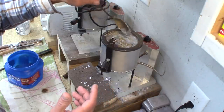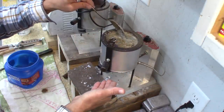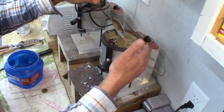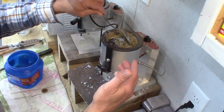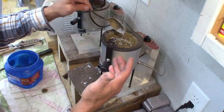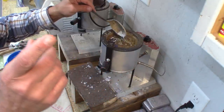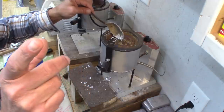Now what you have here — some people will try to go through and get all of this stuff off, but we just added more carbon to the top and you don't have to do that. This is a bottom pour pot. We already clean the lead when we make our ingots, and then we clean it again in our casting pots — there's really nothing else to do. All of this right here is just going to stay on top. We'll set the temperature for casting and leave a little bit in the pot when we're done. YouTube, I'll see you in the next video — if this is helpful, please subscribe and give me a thumbs up.